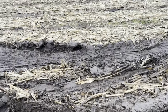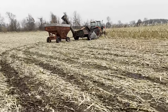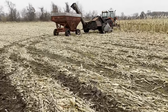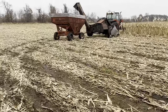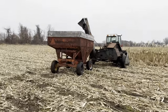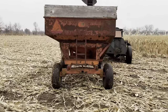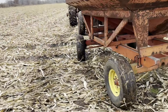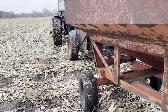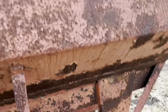Luckily I got a diff lock in that thing. I stomped on that so that both tires would spin, because one of them the diff was letting just one tire spin and I wasn't moving. I stomped on the diff lock though and it grabbed and pulled it up out. I thought I better get out and make sure I don't have a flat tire or something dragging on the picker or the wagon, because it was pulling awful hard. But I guess it's just that sloppy with the frost coming up out of the ground.